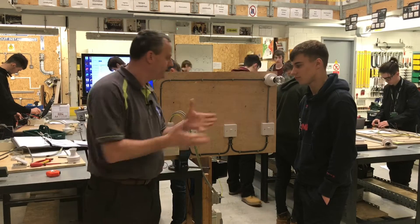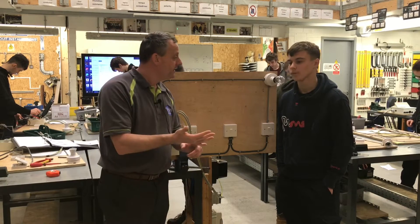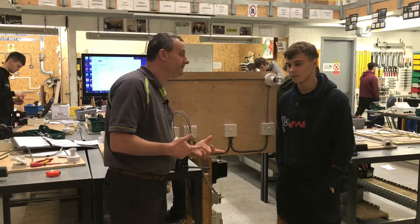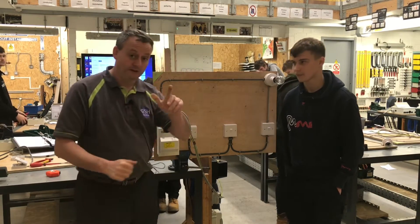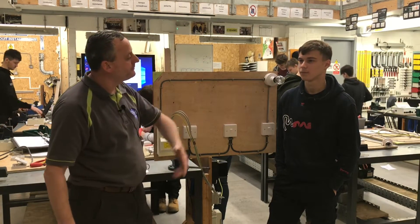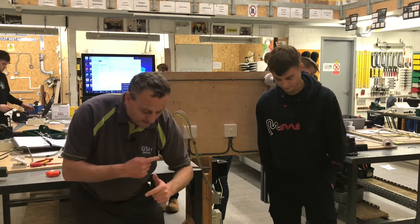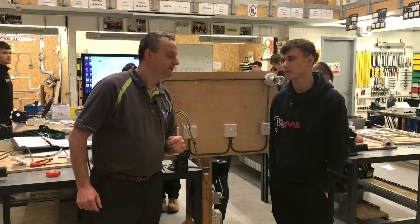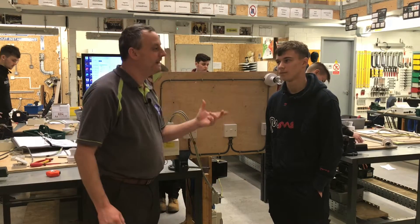In the workshop we've spent a lot of time on health and safety, and now we're at the stage of introducing dead tests. The first dead test — measured in which SI unit? Ohms. We also included another test at the same time as continuity CPC: the polarity test. What do you put in the polarity box? Tick. What does R1 stand for? Resistance of line. And R2? Resistance of CPC.